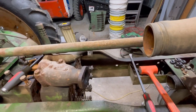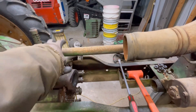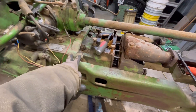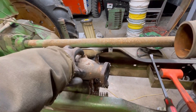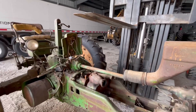Like I said, trying to get that drive shaft out there is easier said than done. You've either got to jerk the radiator out and take the whole thing that way, or split the tractor. What I may end up doing is taking a couple chains, running them around here, hooking the forklift, and trying to get this thing dropped down.